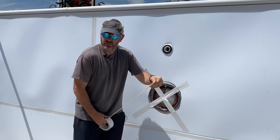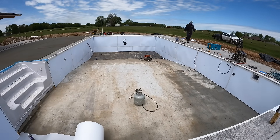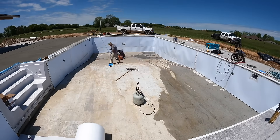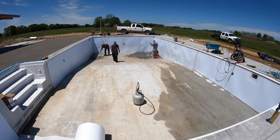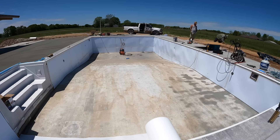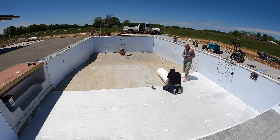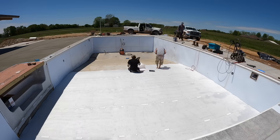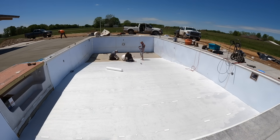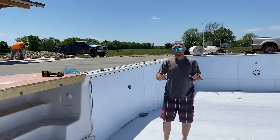James and his guys are doing the flatwork between the house and the pool. We're just waiting for it to dry up a little so we can start sticking the liner foam — the floor foam — down to the concrete. It performs a couple of functions: it acts like a carpet pad, makes it nice and soft on your feet under the liner, and it also protects the liner from abrasions from the concrete. We've done it without in the past, but the floor is pretty hard on your feet without it. We're just using some 3M adhesive to stick it down to the concrete and taping the seams to keep it aligned with no overlap and no gaps.